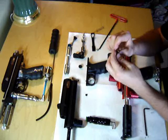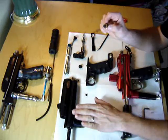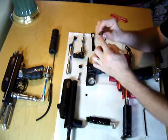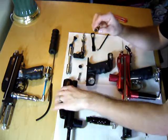When I talk about sweet spotting a regulator, that means you're balancing the input pressure and this spring weight, trying to make that balance against how hard the hammer is hitting. We'll get to the hammer in just a second.